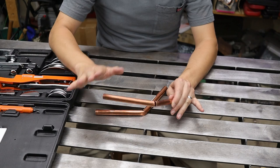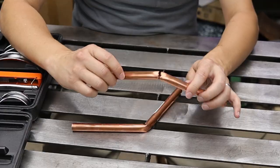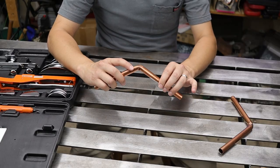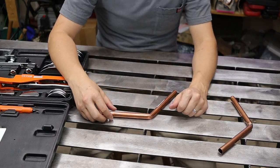It may not be able to do M-type copper tubing. This is some half-inch M-type, and the first one just totally broke right through. I spaced out the spreader bar on the second one and it still did kink it, but didn't break through. So with copper tubing, it may need a little more practice.